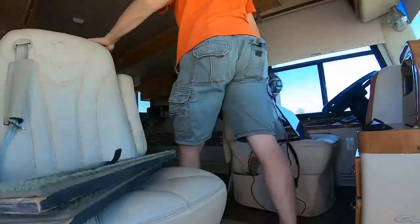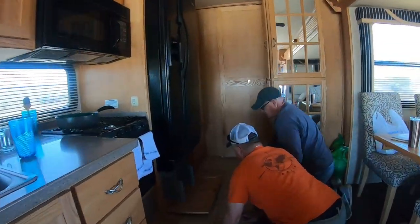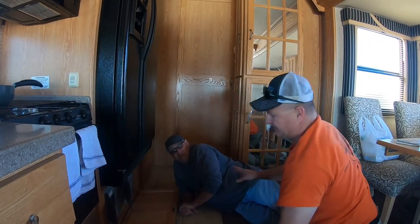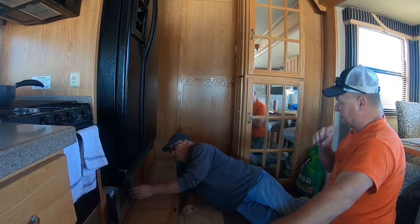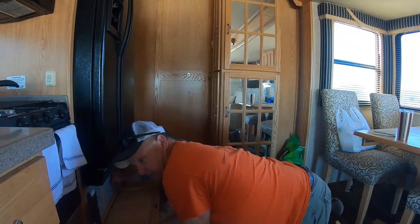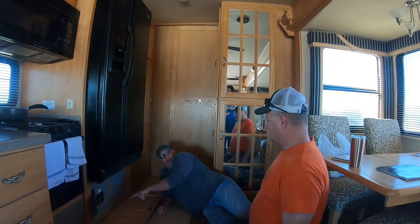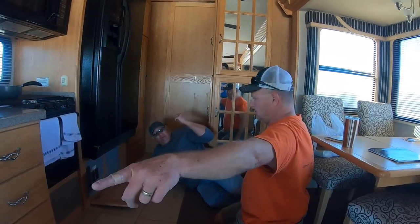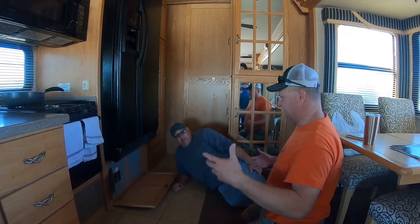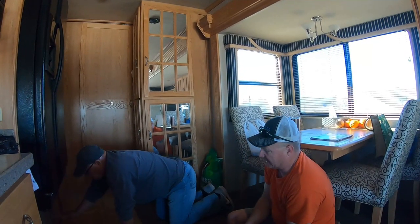Wow, this thing is roomy. Oh, good. Main panel, inverter panel. I have to pull the panels off and see what they tied into what, but that doesn't stop you from going ahead and installing your stuff, because your bay's right there and the breaker panels are here. So we're going to eliminate all that mess. We only need to wire from here then? Yeah, from your inverter to here. And from here to wherever, we've still got to figure out the whole transfer switch thing. It might even be possible that it's back there underneath the cabinet, but I doubt it.